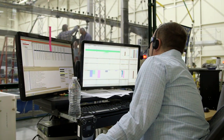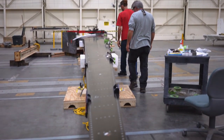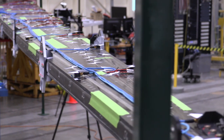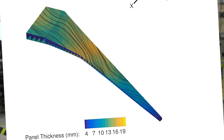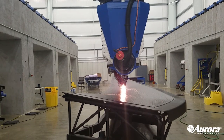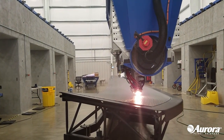There are several differences between this wing and a traditional wing. First of all, it's built out of composites. Some of the newer aircraft we see being built in commercial transports are built out of composite. But it's different from those, not only in the shape, the geometry, the length and the width and thickness, but also the biggest difference is in the skins — we're actually steering the composite fibers. With this particular design, we're trying to tailor that stiffness, and so instead of going straight along the wing, we're actually curving that fiber in the plane of the wing so that we can change the stiffness along the full length.